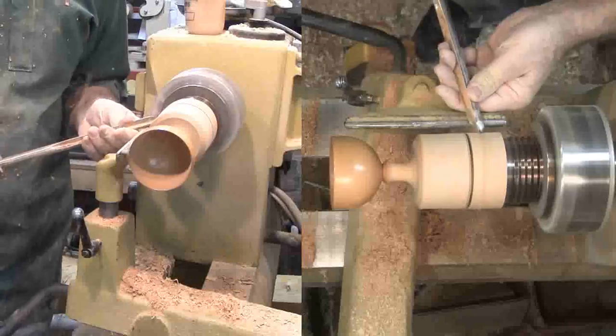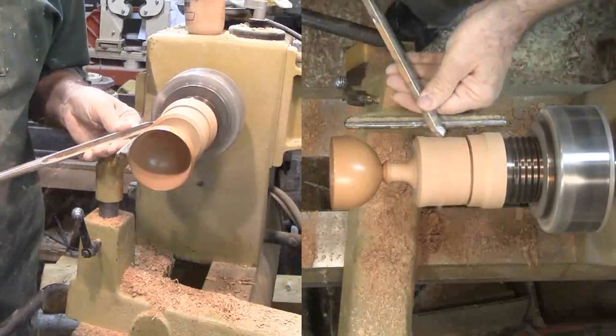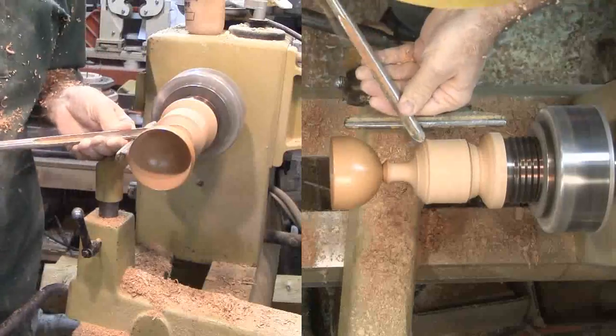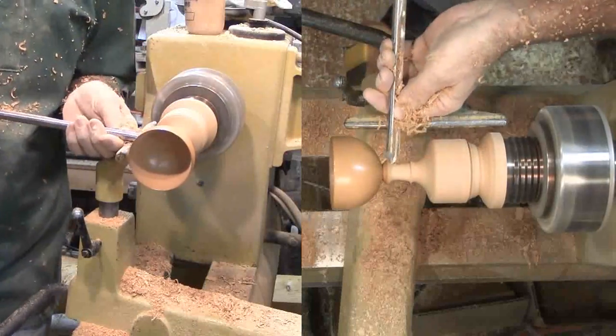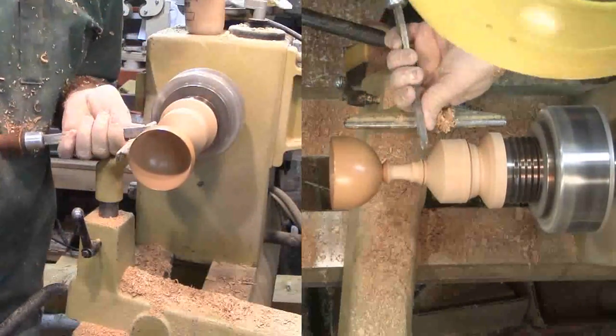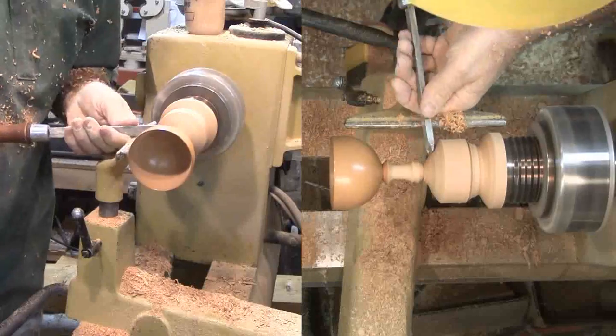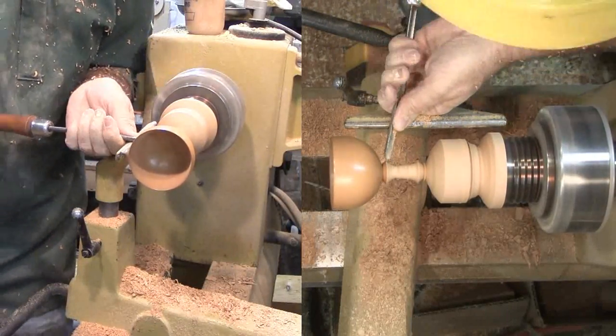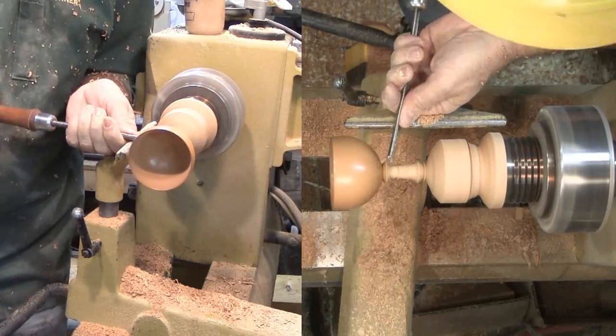The middle portion is much like a finial. I'm too far away from the tool rest to be comfortable with a skew, so I'll use a gouge. I almost cut a sharp fin in the middle of the spindle, then I smoothed it out thinking it would be uncomfortable to hold with your fingers. I can use my skew for the base.